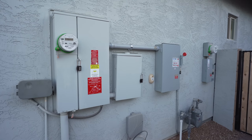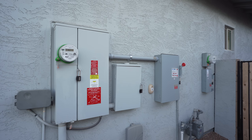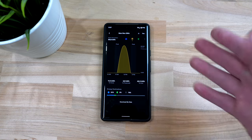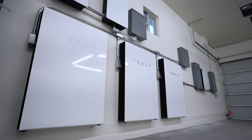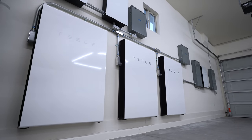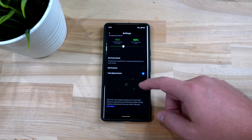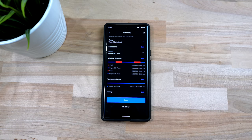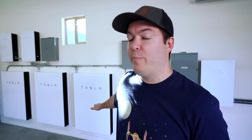When it comes to power walls you may not need as many as I have, but here in Arizona it's a little different. We have peak pricing and the hours extend into times when the sun is not up. The way it works with my electric company SRP: in the summer from 2 to 8 PM we are not supposed to pull from the grid — if you do you get hit with some pretty steep charges. In the winter it's from 5 to 9 AM and PM, right when the sun is not shining. So during those peak times we only pull from the power wall and not from the grid. I have it all set up in the Tesla app with time-based control, which is made for plans like mine that have peak pricing. They recently updated it so I can have multiple seasons and multiple peak pricing hours. In the morning our solar panels will charge up our power walls, and then when it's peak pricing our house will be powered by solar or the power walls.